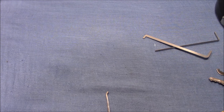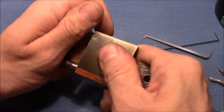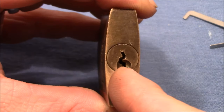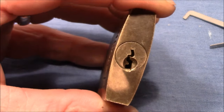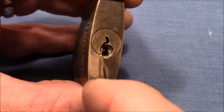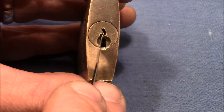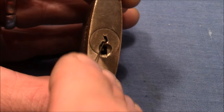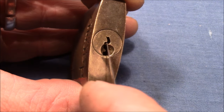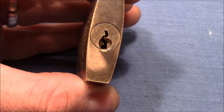And we have had nice wide open keyways and standard pins so far, but this lock is different. You can tell from the keyway that this is not nice anymore. It's very paracentric, narrow, curved. So therefore I've included this pick here, so you can insert it here, and with a little bit of effort, you can reach up into the pin chamber and pick the pins. And as we use this area of the keyway, that area is actually unused, and therefore I will use it for tensioning.